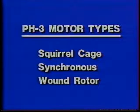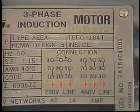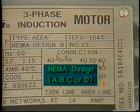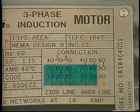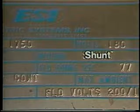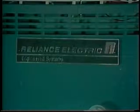Like single-phase motors, three-phase AC motors can be several different types. The nameplate will clearly identify less common types like wound rotor motors. Standard three-phase induction motors are supplied in four NEMA designs — A, B, C, and D — with different torque and current curves. DC motors are also available in different types. A shunt wound motor will have radically different operating characteristics from a series, compound, or permanent magnet motor. Do not replace one type with another. Often DC drive motors are matched to their controllers and must be replaced with the exact same motor from the same manufacturer to work properly.